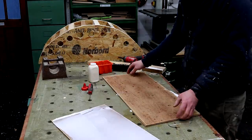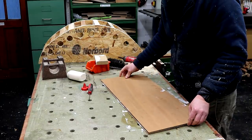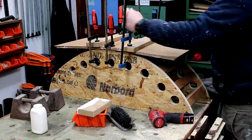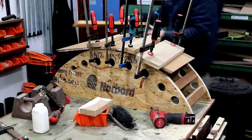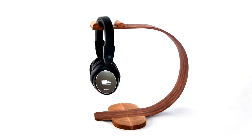I sandwiched the boards together, making sure to face all of the surfaces that had that old finish and stain on them inwards, so that I have the clean sides of the plywood at the top and bottom. I then started clamping from the centre and working outwards - this is going to form the shape of the board. This process is called bent lamination, and this is only the second time I've ever done it; the first was when I built a headphone stand.